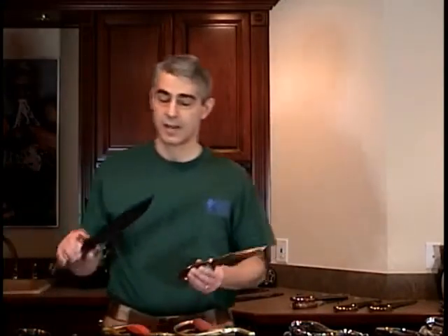For a long weapon like that western sabre, there really is no other choice besides carbon steel. Combat knives are a lot shorter and fatter from a relative ratio perspective than that long saber. Consequently, you have an additional steel option — stainless steel. Weapons grade stainless steel is not truly stainless; it will stain. It's not no maintenance, it's low maintenance, but the maintenance is one heck of a lot less than required for a carbon steel.